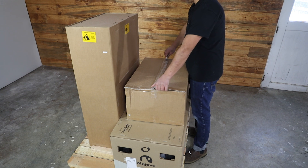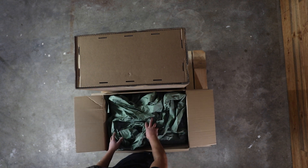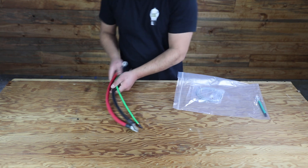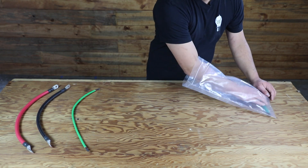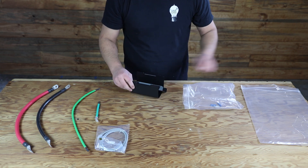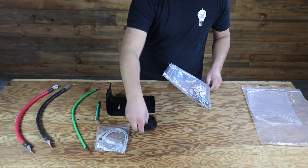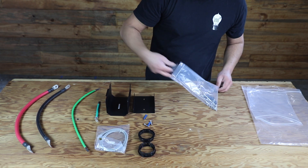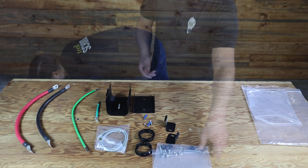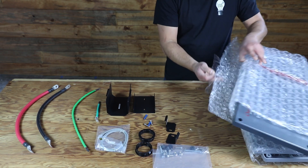Let's begin opening the accessory box. Inside, you will find three accessory bags and battery exterior covers. One bag will contain battery to inverter connections, a grounding conductor, a negative to ground strap, and a CAT-5E cable for BMS communications, a wire raceway with mounting screws and drywall anchors. Another bag will contain battery anchor brackets, plastic bushings, hardware with lag and hex screws with washers and rubber bumps. And finally, three battery exterior covers that get mounted after system installation to avoid cosmetic damage to the covers.